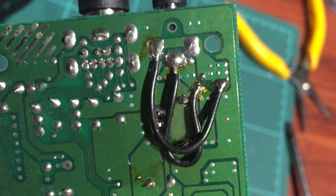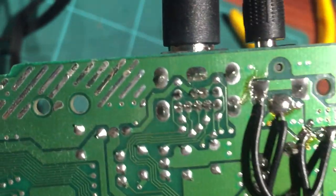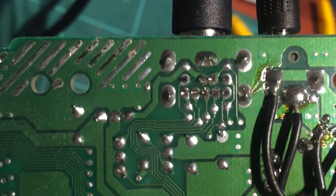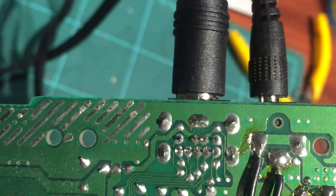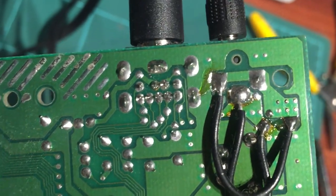So we've quickly found our issue. It's actually not the power circuit - whoever did that soldering, it's not the neatest job but it seems to work. The problem is actually over here on this multi-out circuit. Let's just quickly reflow these solder points and we'll test again.